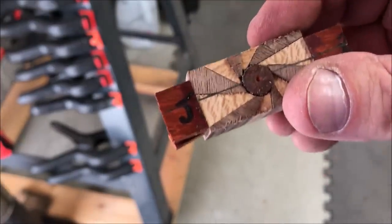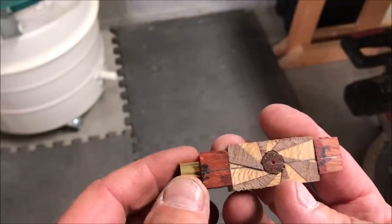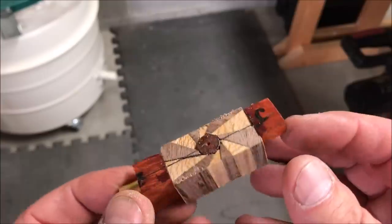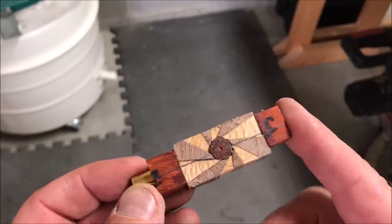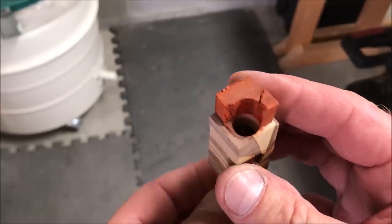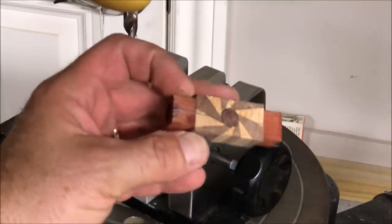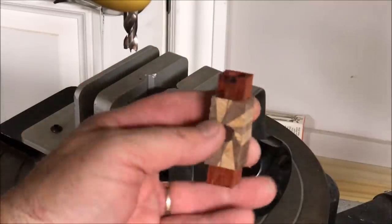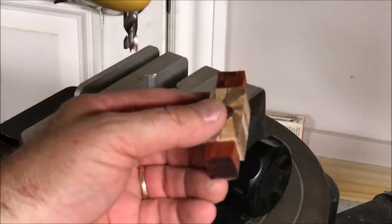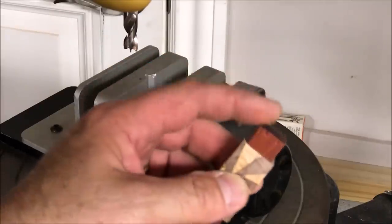I popped a tube into the blank and it looks like we did a pretty good job going right down the center — super happy about that. We'll cut the blown end off, run it through the sander, cut another piece of padauk on the bandsaw, get it glued up, and once it dries punch the hole right back through it. I cleaned up the end and glued another piece of padauk on. Now we'll carefully line the blank back up, making sure there's no binding of the bit inside the existing hole, and gingerly cut our way through the bottom of the blank — we don't want to take any more material away than necessary.